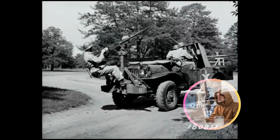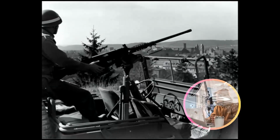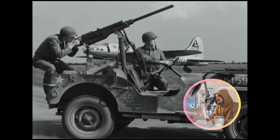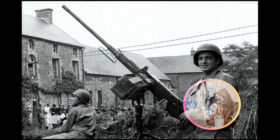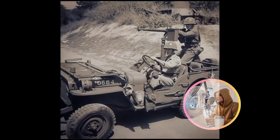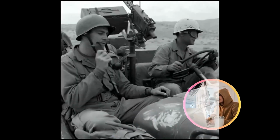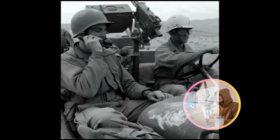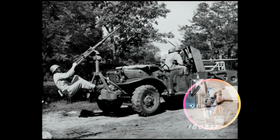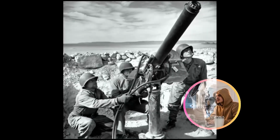The innovative springs fashioned by Staff Sergeant Cupp possessed a natural frequency of approximately 3.2 Hz, a characteristic precisely aligned with the specifications outlined by Aberdeen's engineering experts, determined by their physical dimensions and the weight they bore. Remarkably, Cupp did not arrive at this figure through complex computations. Instead, his practical experience informed him that the comfort of tractor seats in uneven agricultural terrain necessitated compliant springs, a principle he instinctively applied to his gunner's platform for an identical purpose, mitigating jarring movements.